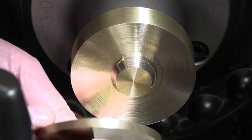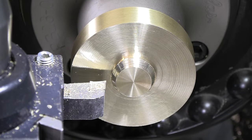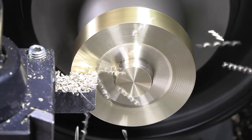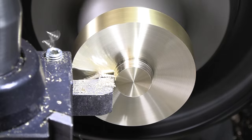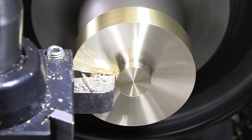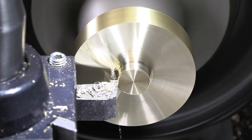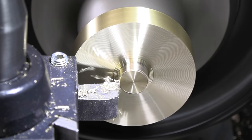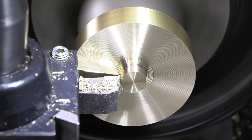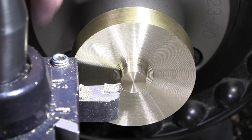And there we go, once again, saved a nice big brass washer off of that. And with that little skinny tool, definitely saved a lot more material out of this one. And yeah, I got about 25 thou there. I'm at 603 going for 547. I'm gonna have to finish that with the boring bar. Let's get this faced off to our proper width and then we'll get that marked.